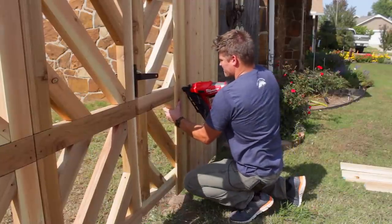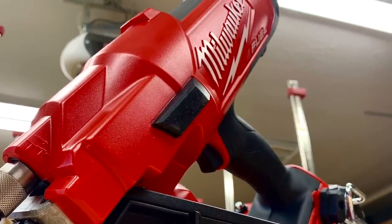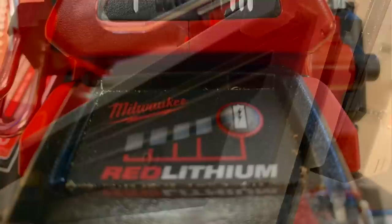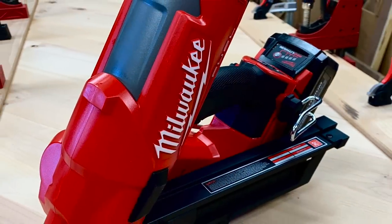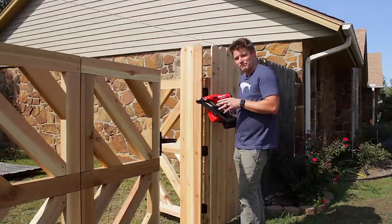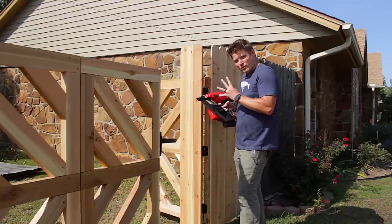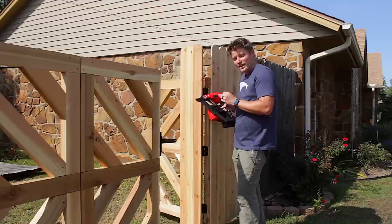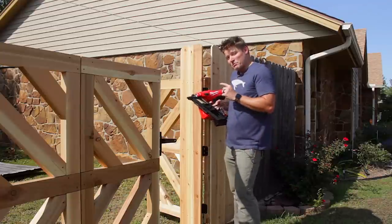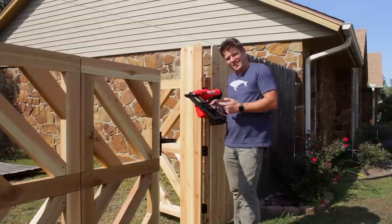If you're curious what I'm using to put these planks in place, I just acquired this tool — it's the 18-volt Milwaukee Fuel 30-to-34-degree framing nailer. A couple of features I like: it's battery-operated with power indicators on the back side, it has mode selections for single fire or multi fire, and you can turn the power on and off when not using it so you're not draining the battery inadvertently. Most guns when they run dry will keep firing and you don't know it until it's too late; this one stops firing with about four nails left in the magazine and won't let you shoot anymore until you load more nails. I have a link down in the description to pick one up at Home Depot.